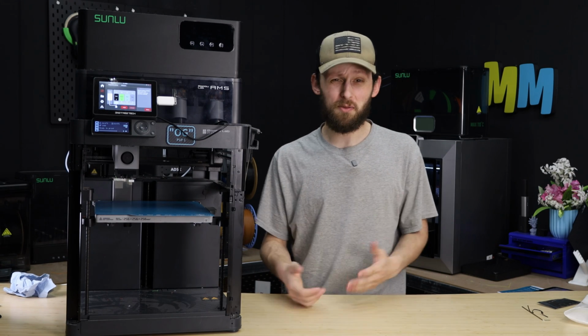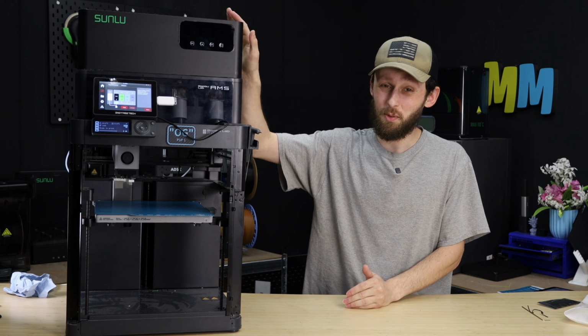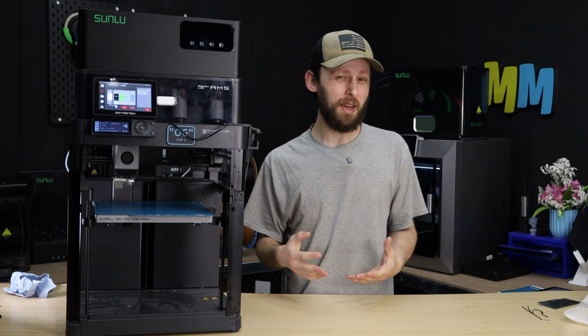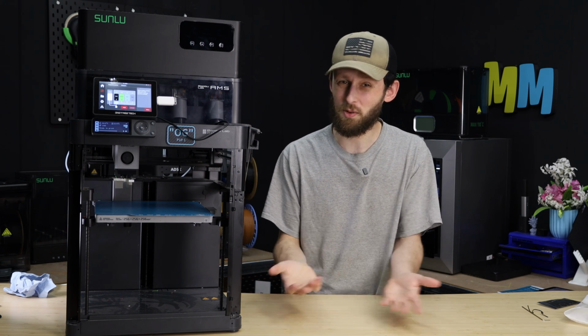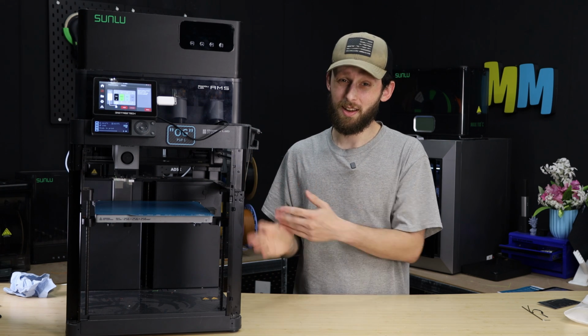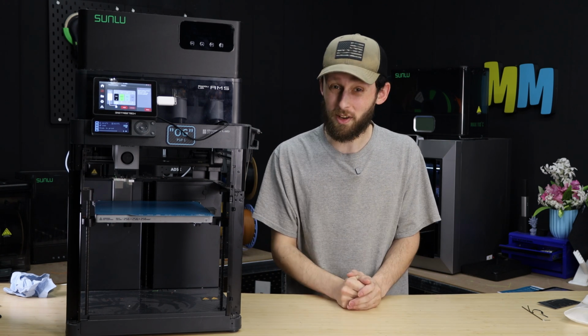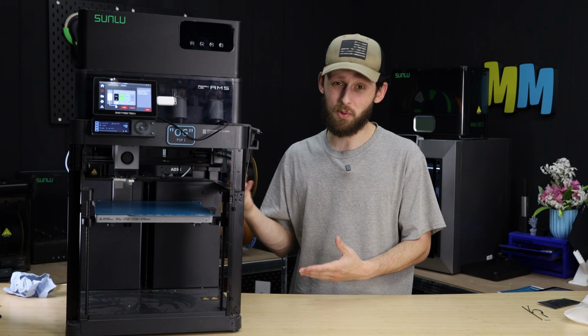It's about a 5 to 10 minute installation when you're not filming everything, and it mounts right on top of the regular AMS system for the Bambu Lab printers. Now, I would still recommend pre-drying your filament before you load it into here because it's obviously not gonna dry everything immediately. So if you're gonna use this solely as a dryer, just put it in there overnight and set it to dry, or put it into a different unit while you have other filament printing in here.